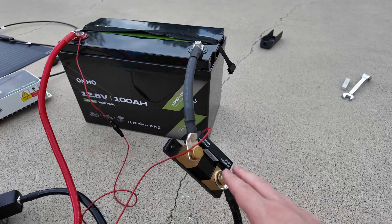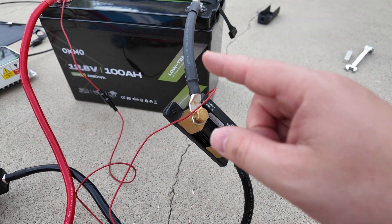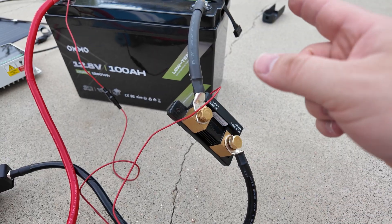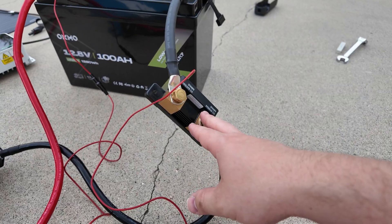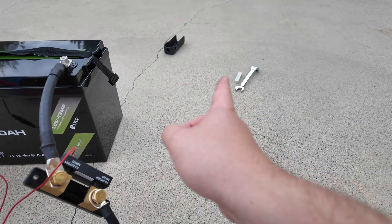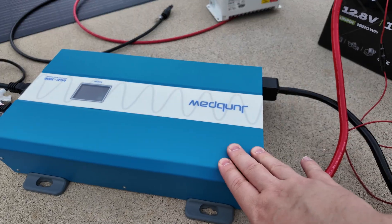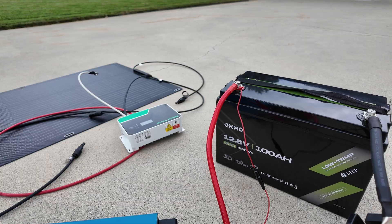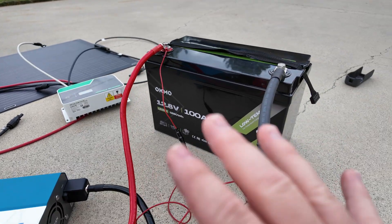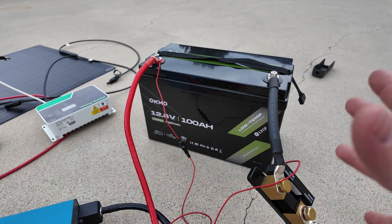This is all my own non-sponsored thoughts on how to make your system better. The shunt is 100% optional. You don't need a pre-charge resistor, you don't need a giant inverter — a 1000 watt inverter works fine. You don't necessarily need the MC4 disconnect tool either. But all of these things make it substantially easier. The fuse, however, I think is non-negotiable.